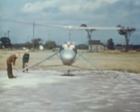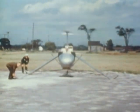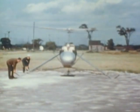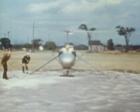Accordingly we decided that perhaps the bar should be made to follow the mast a little more rapidly. Here we are measuring, very similar to the work that Art did back in Paoli — you can see the angle that we go through and then clock how fast the rotor is following the mast with a stopwatch.